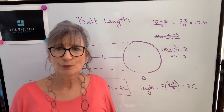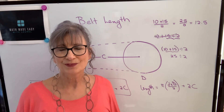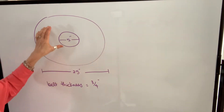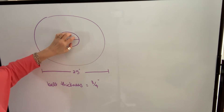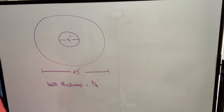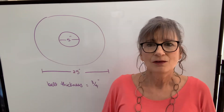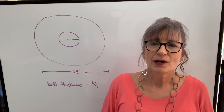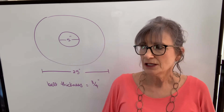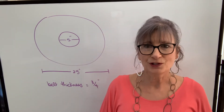The other calculation you might be asked to do with belt lengths is to calculate how much belt is rolled up on a coil. So let's take a look at that. In order to calculate the amount of belt wrapped up in this particular coil, I need to know the core diameter, the outside diameter, and the belt thickness. Again, I can give you formulas to calculate this, but what I want to do is show you how I can do this question without the formulas. Because to me, if you understand the process, you're going to remember the formulas better — or you won't need the formulas to do the calculations.